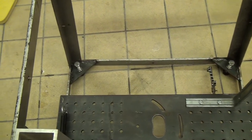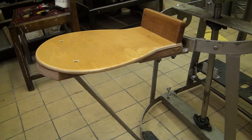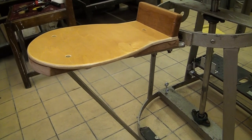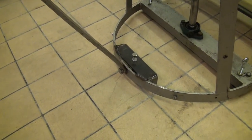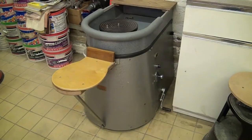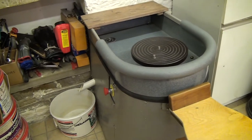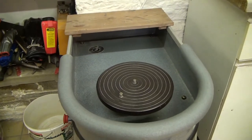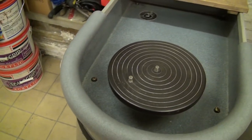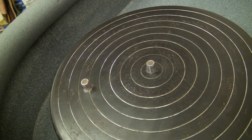These are the rear adjustable levelling screws, replacing the original legs with now heavy-duty plastic feet. I've shortened the seat and given it a more comfortable wider top. And beneath there is the new front-end levelling screw. And so, here's the finished wheel, with the top tray and outer panels refitted, complete with the slurry drain pipe connected. I fitted these two stainless steel posts to the wheel head, suitably positioned so that they fit the bats that I use on my other wheel, so that they are interchangeable.